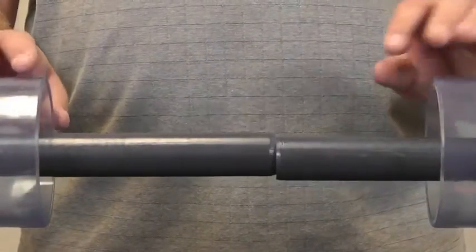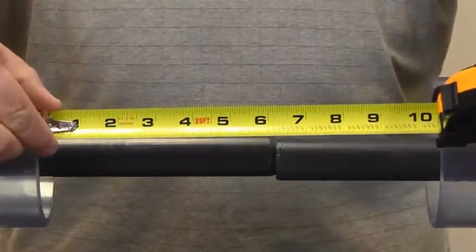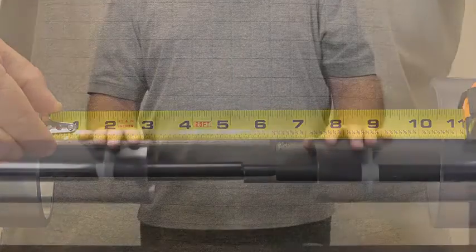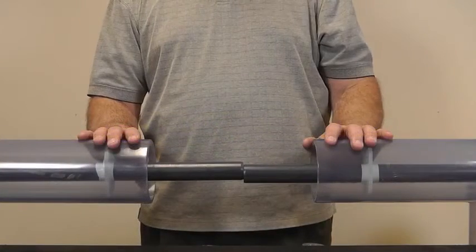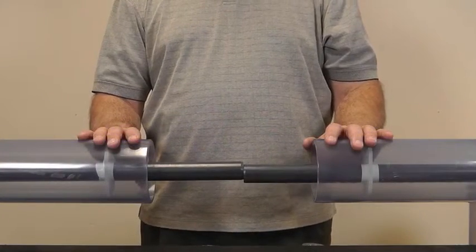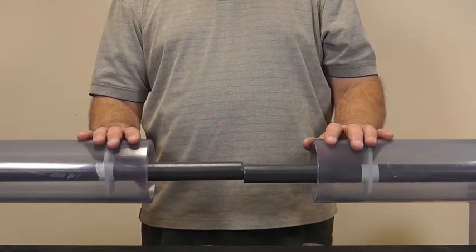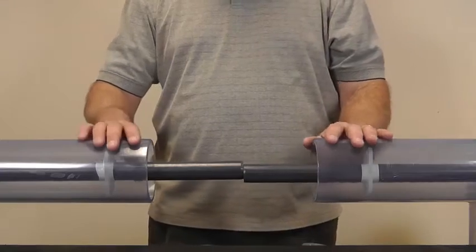The closure fitting for 4-inch containment pipe requires an opening between 10-1/2 to 12-1/2 inches. Before you begin, you'll want to verify that you have sufficient movement in your piping system to allow for installation. If you do not, you'll want to check your restraints to allow for movement.